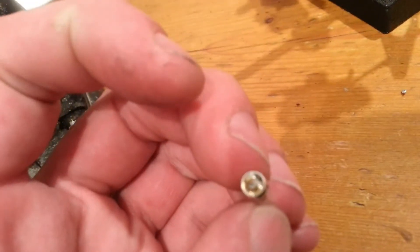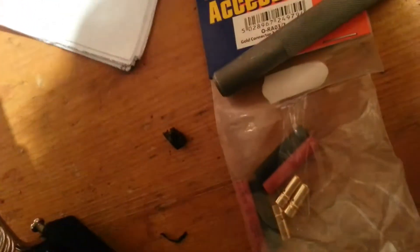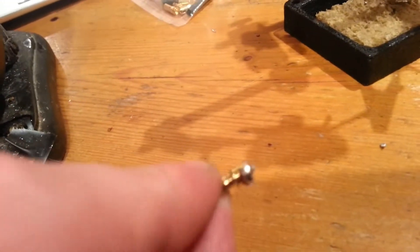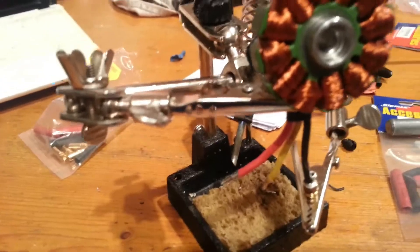Some of the solder was white - basically what happened was the insulation got mixed up with the solder reaction. The solder was poor quality, and because the wires were under stress and vibrating, they eventually snapped. Watch out for that with these motors or any motors.